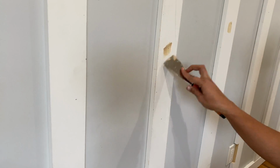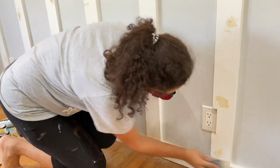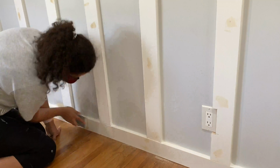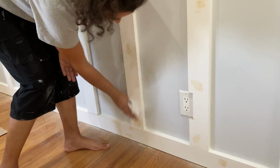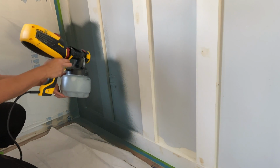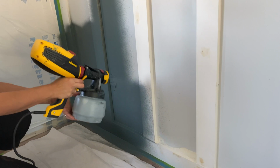Once all the boards were in, I patched the holes with wood putty and filled all the gaps with caulking. The next day, I sanded the wood putty and I also sanded the entire board. I used pre-primed boards, but I wanted to get them nice and smooth, so the finished wall was smooth. To prepare to paint, I took a wet rag and cleaned up the entire wall to remove all the sanding dust. Now you can paint it with a brush and roller, but I used a paint sprayer to paint quickly and to get a nice smooth finish. You can read more about it in the article I've linked in the description.